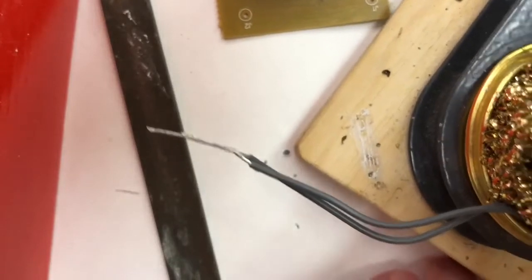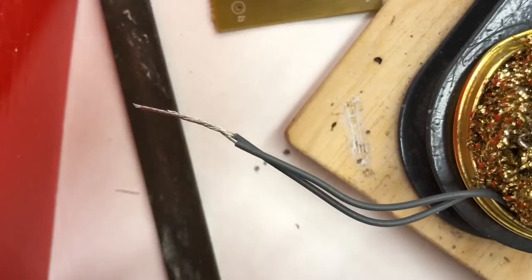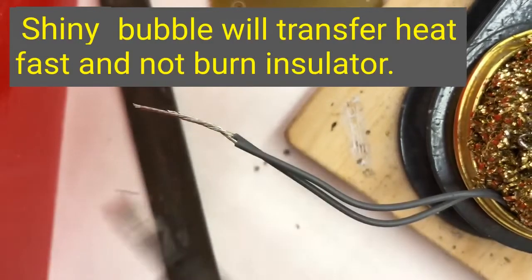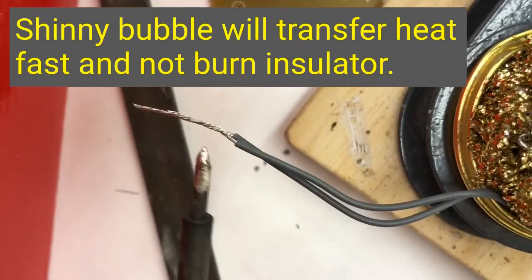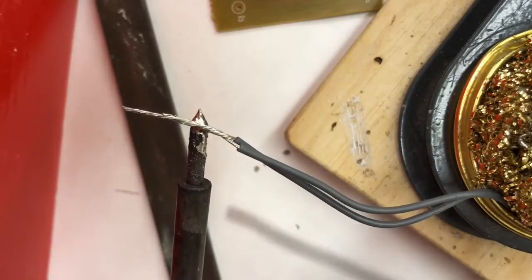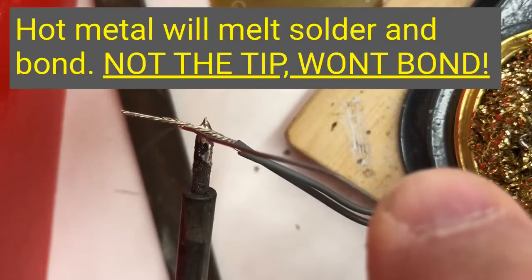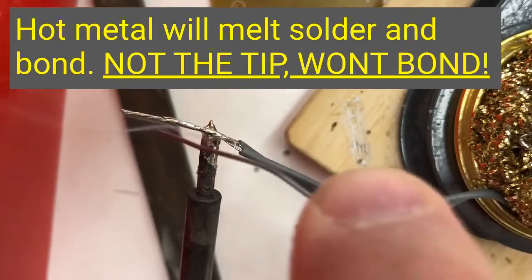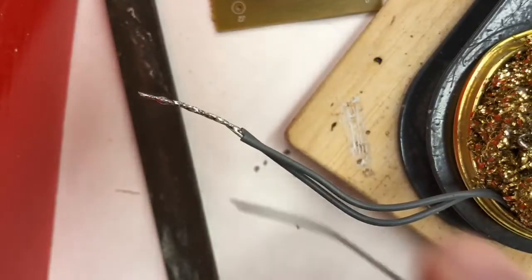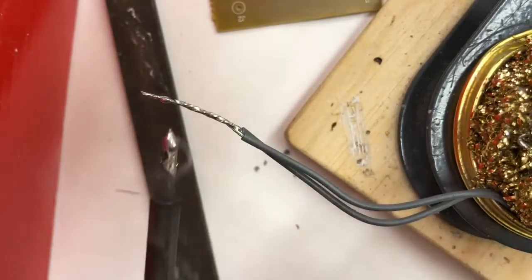We're going to clean the tip one more time and tin it. If you look at that tinning bubble and turn it, you can see the bubble — we're gonna touch the wire with that bubble facing up and you'll see it wrap around a little bit. Hold it steady, not moving — count one one-thousand, two one-thousand, three one-thousand, four. Let the metal melt the solder, not the solder iron. No petting it, no moving the iron — just hold it in a steady spot and let go. That's fully shiny and fully covered. If you have to go back, touch it up with another drop and it melts everything super fast because it's already coated.